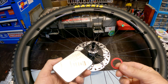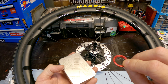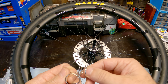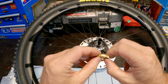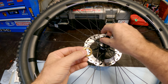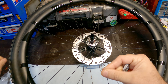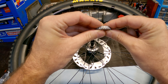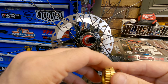The red ring wasn't explained on the exploded diagram, so I tried it a few different ways before I figured out what it was for. With the hollow star ratchets, the spring disappears inside them, which leaves things sitting too low and causes the second ratchet to catch incorrectly. On the original solid ones, the spring acts as a spacer and prevents it from going down that last millimeter or so. So the red ring is a spacer.